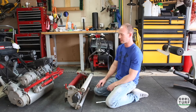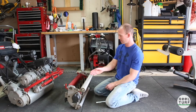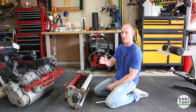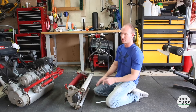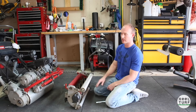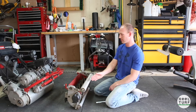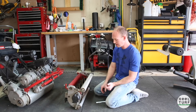When I say something is off and it's just not cutting the way it should, we're talking about thousandths of an inch — 0.001 or 0.002 or something is the amount of tolerance we're talking about being off. Those thousandths of an inch make a big difference. So I went back to the manual, went back to the real basics, and just kind of started over with how Toro recommended to square this all back up and make sure everything's good again.